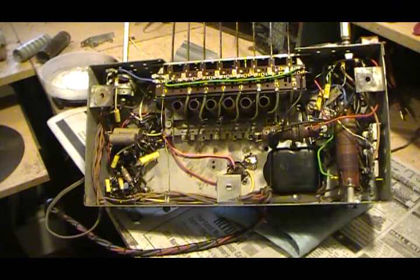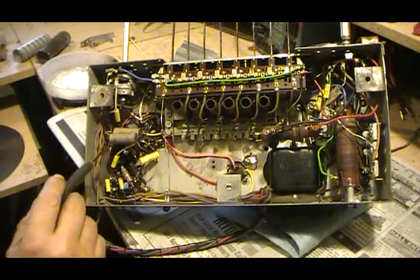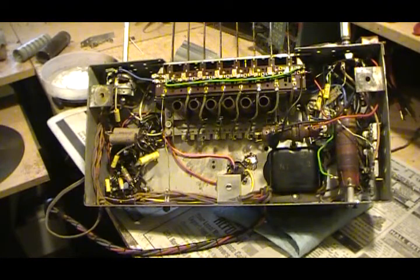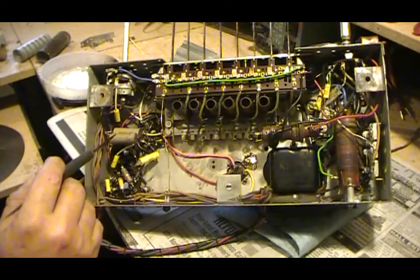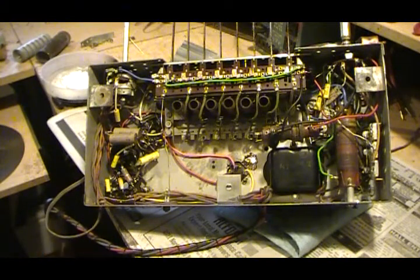Now all the components are in. This was that sand dome resistor — it was a 5-watt power resistor. I didn't have the right value; it's a 12K. So what I did was I put two 22K 5-watt resistors in parallel. That gives me 11K — it's actually just a little above that, about 11.5K. So that's plenty close enough for that dropping resistor.